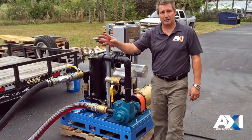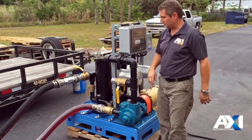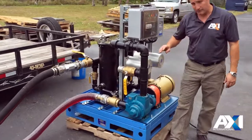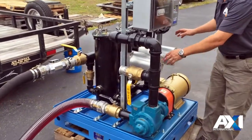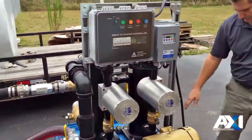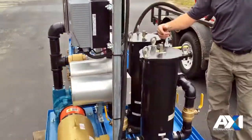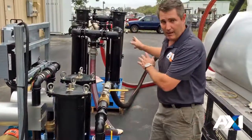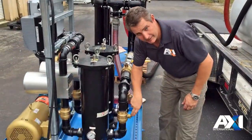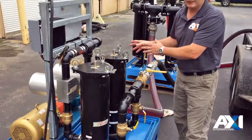So after going through the pre-filter and the water separator where we can isolate sides and change bag filters, it comes over here to the second skid through the pump, through two magnetic fuel conditioners. And around this side we have the particulate filters — the cartridge filters. Same as the bag filters, we can isolate one side and change that one while the other is still doing 90 gallons a minute.